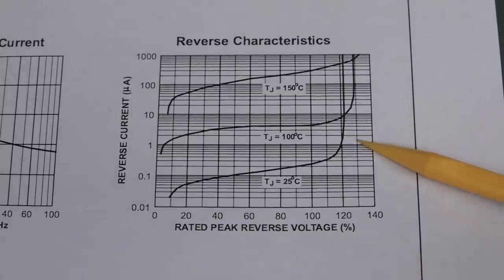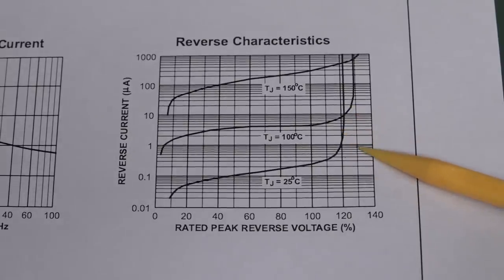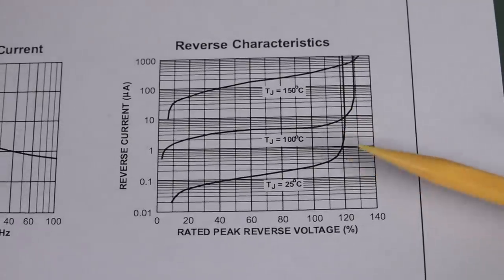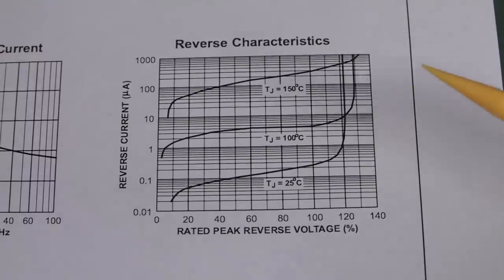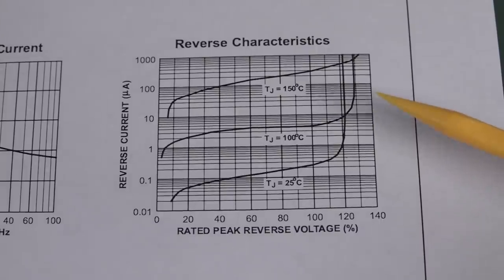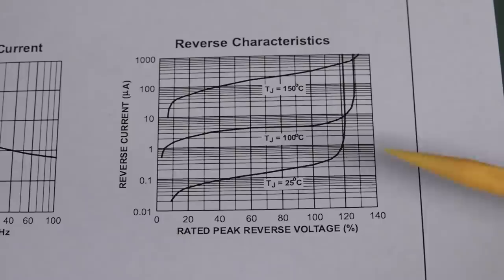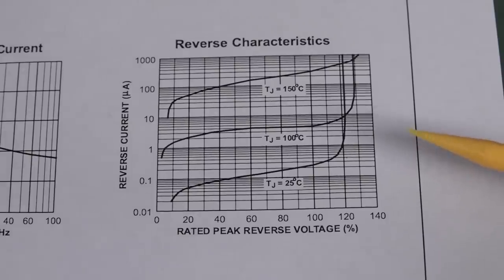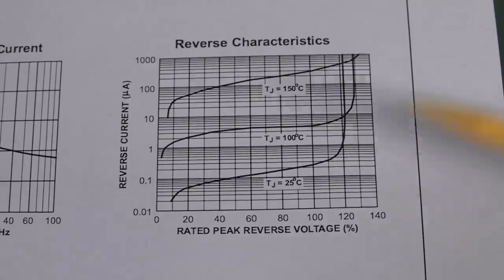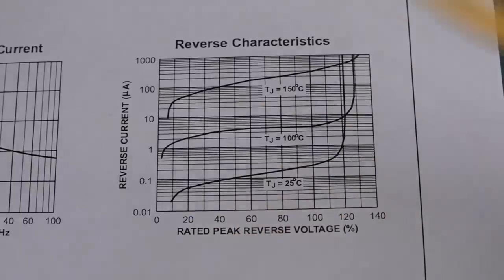This doesn't mean the diode isn't the culprit. You could very well have a faulty diode in there with excess leakage. So if you've got this sort of problem, it can be in any multimeter — actually any product that has batteries. You might typically have a reverse bias diode like this. If you can afford the luxury of the voltage drop, you'd put the diode in series with the batteries, but then you get a 0.6 volt drop, and on a 3 volt battery that's pretty crippling. This is cheap and simple, and it could certainly have come a guts.